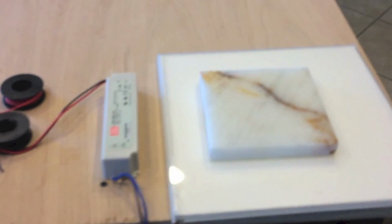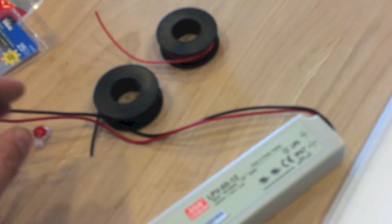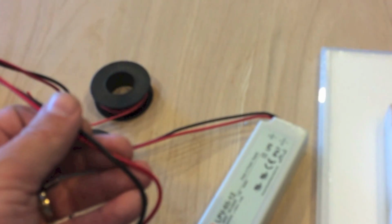The big challenge in this project is going to be the wiring itself and the concealing of the wires. You definitely want to consult the manufacturer's documentation and get the specifications. So I did that, and I see that these panels each draw 0.16 amps per panel. They run on 12 volts DC, so the manufacturer supplied me with one power supply, which is good for up to 20-some panels. This is a 5 amp power supply, and then we're going to wire all the panels in parallel to the output DC circuit.